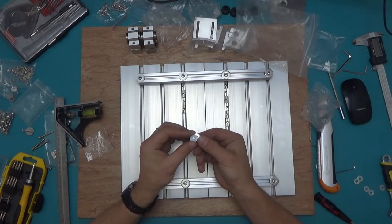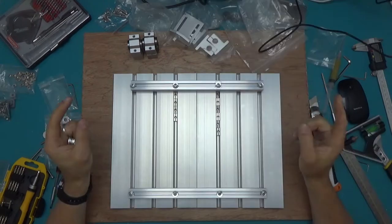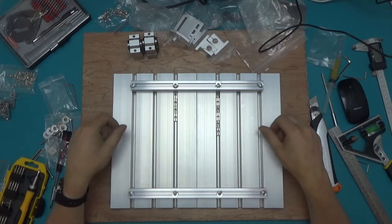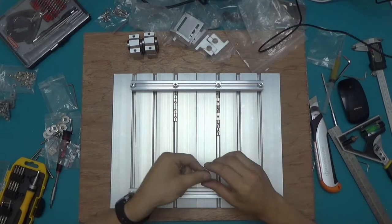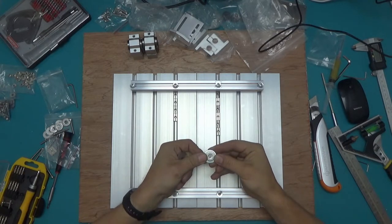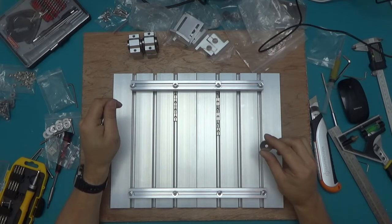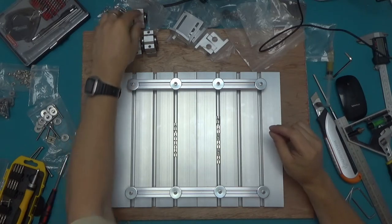This one started pushing through the washer — I'm not happy with that. Those washers don't seem to be the right size. I found some better washers. I stepped away for a moment and came back realizing I couldn't bear looking at those deformed washers — much too flimsy for the force needed to clamp this down properly. I found some penny washers: larger diameter, slightly thicker, with a center hole about 2mm smaller, so the hex bolt head won't push through. My OCD should be satisfied.